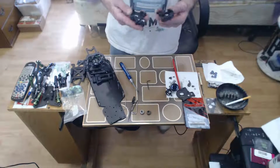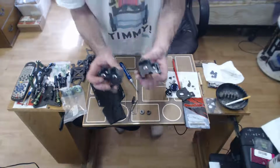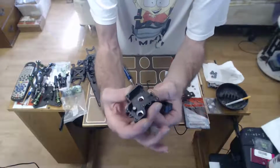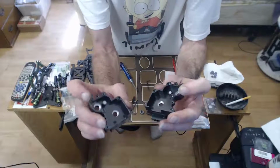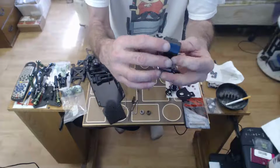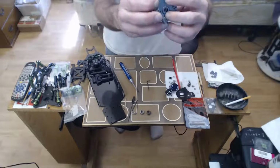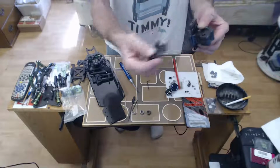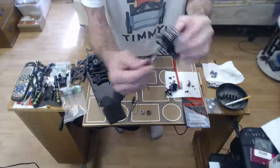Now we can come apart. It's really nicely machined on the inside. A nice recess, but you see both sides, bearing release on both sides for the top shaft. So that's what I think. I think they make the cases and the way they designed it in such a way that the motor plate can... Now it's just a different motor plate is what they're doing, and this one will go over here.